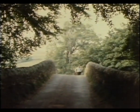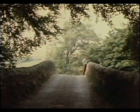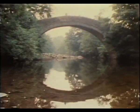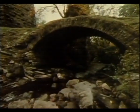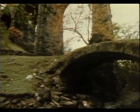So, bending forces can break stone. When bridges were made from stone, the engineers had to avoid bending forces. Can you work out why they made arches? In an arch, all the forces are pushing forces, and stone is very strong against pushing forces.